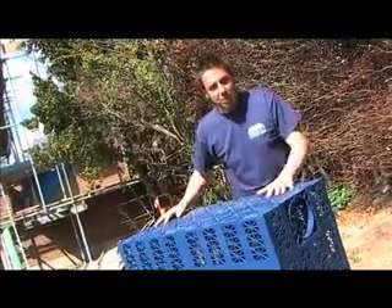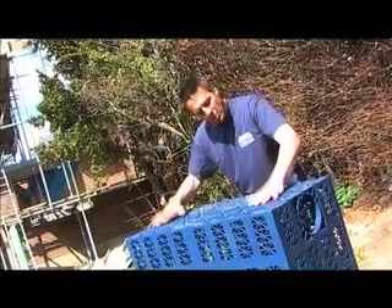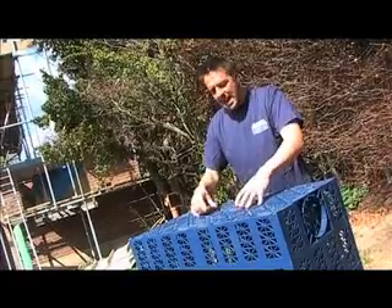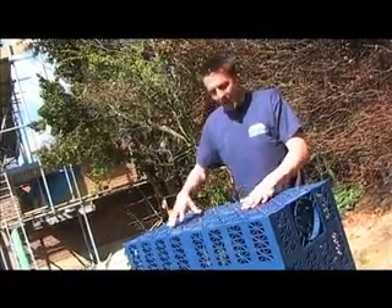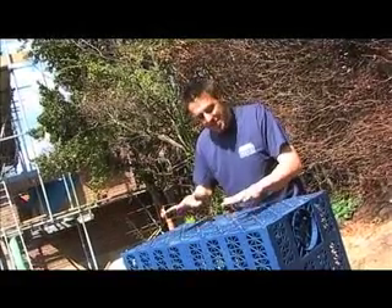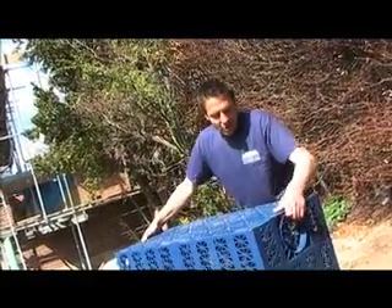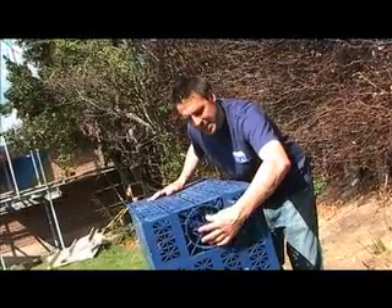Installation of these is very straightforward. You dig your hole in the same way, put down a bed of shingle, then put your crates in and wrap them in a garden fleece — this is to stop any solids getting into the open part of the crate, while still letting the water drain out. These can take a heck of a lot of weight. They come in two colors: the green ones are for normal domestic use, and the blue ones can actually take the weight of a vehicle. We may be putting these under the driveway — we haven't quite decided — but that's why I've got the blue ones. Installing them is very straightforward; there's a knockout at either end, so you've got a lot of versatility.